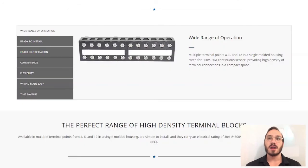The heavy-duty design carries an electrical rating of 30 amps at 600 volts AC. We mold our terminal block housing from unbreakable thermoplastic, and we use quality zinc-plated brass and electrolytic copper for our metal parts for excellent conductivity and to minimize corrosion. Integrated IP20 terminal guards prevent accidental contact with live parts.